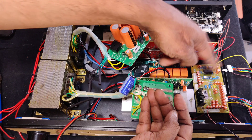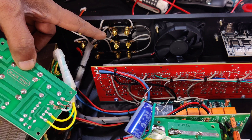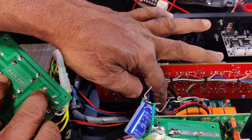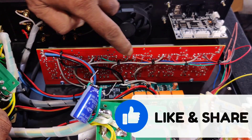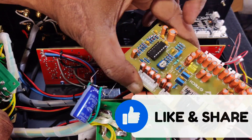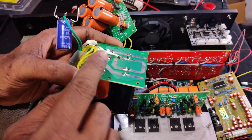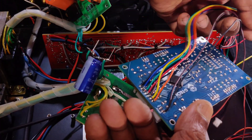This 12 volt will be used for running those two circuits. I have connected the 5.1 channel speaker outputs to banana sockets made on an acrylic sheet, and the connections from there go directly to the speaker protection board and then to the 5 channel output. These points are the inputs, coming from the control board where there is a 5.1 output switchable via remote control. For the subwoofer section only, there is a manual volume control for leveling the bass with the channel speakers. You can see the 5 channel input being connected here.